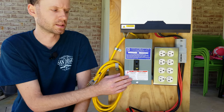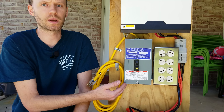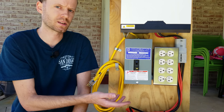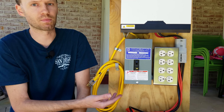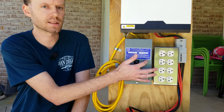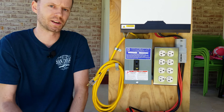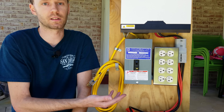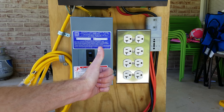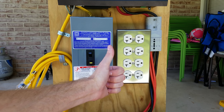Regarding the grounding itself — this is designed to be a mobile solution used out in the field, and there's just no practical way to carry around an eight foot ground rod. You could have a ground rod if you're going to charge it outside with solar or in a shed, but when you're on the go it's just not practical. One idea is a strap with a wire connected to the ground lug that comes out, with an alligator clamp you can clip onto a nearby pole. If anyone else has ideas on the grounding side I'd love to hear suggestions. I hope this helps solve some of the questions asked. If you have further questions please leave them in the comments, and don't forget to smash that like button — thanks for watching and I'll catch you on the next one.